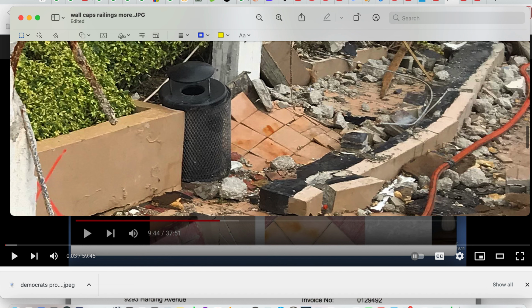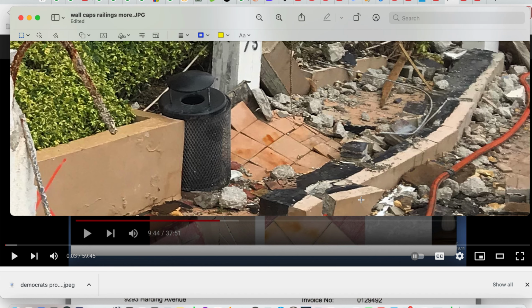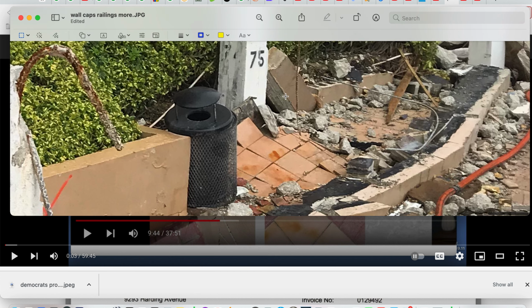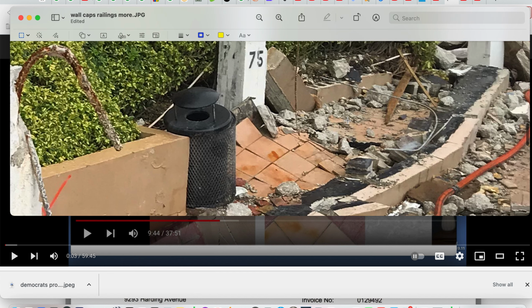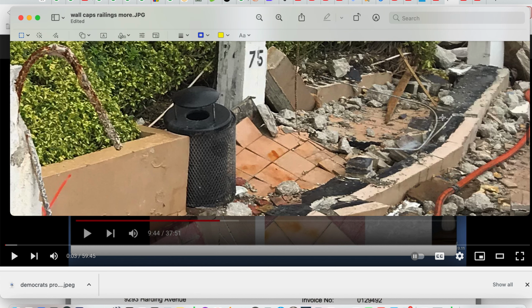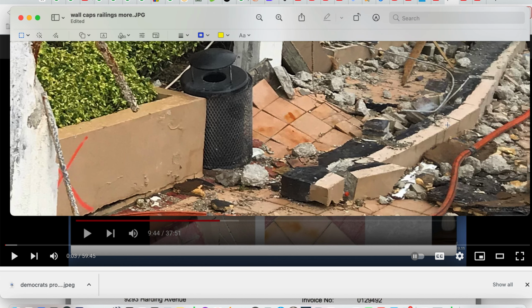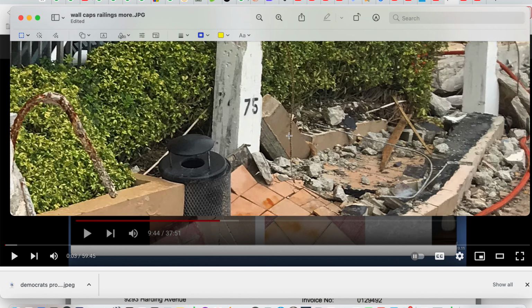And you see the profile of it. From here to here is a little bit further out. So you can see the shape of it. You can start seeing the shape of this cap and profile its distance from here. And you start seeing, oh, okay, this had a bending action right about here, and that's where the ejection started. And it was abrupt, and it was fast. It ejected it off, and there's the profile of the ejection, if you will. Literally, you're looking at the profile of the ejection.